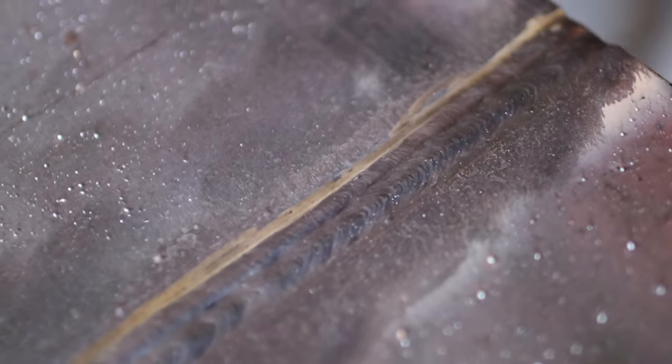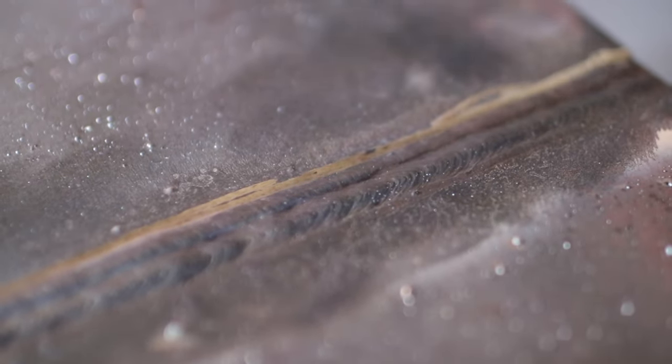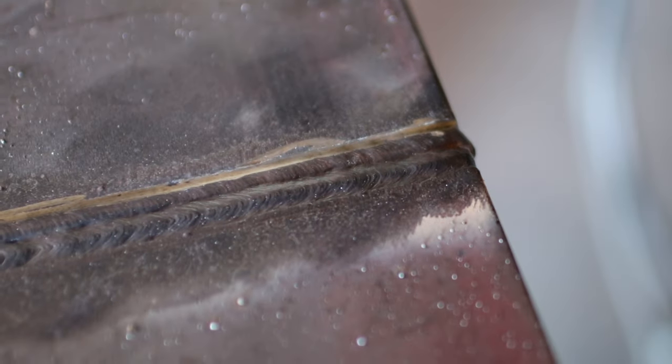So guys, as you see, we went ahead and ground the line under the weld. Now, whenever I place my rod in there, I'm gonna place it about right here, and watch my puddle fill in this guideline and go to the edge so it can stay straighter, all right? So let's go ahead and cap it.